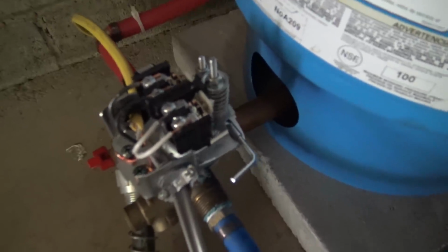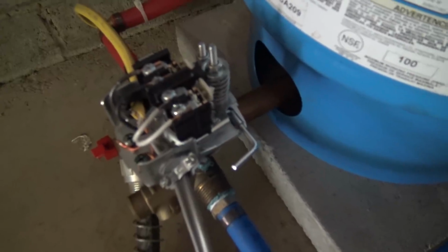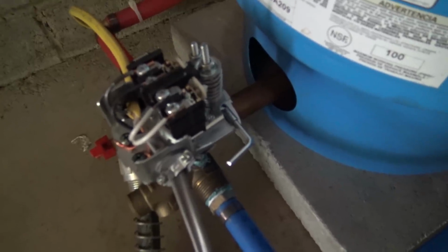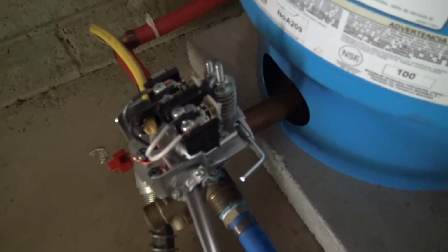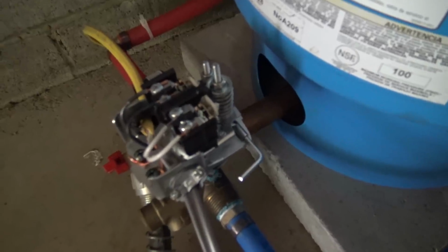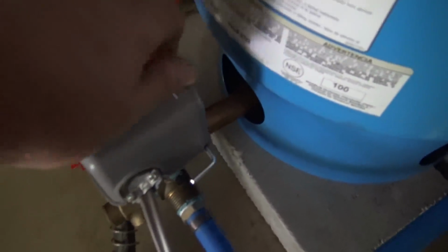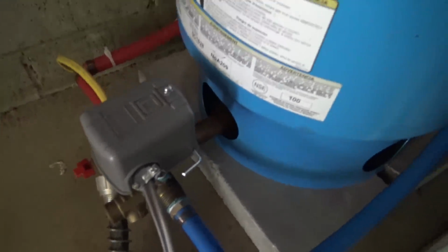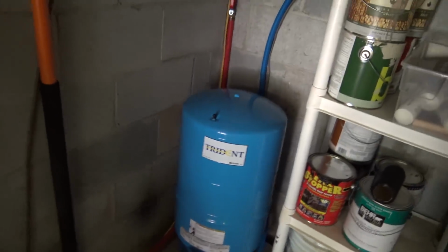If there were pipes busted, freezing, whatever, or they forgot to shut something off, this allows them to save their pump. The pump has dry protection built into its circuitry, but this is a mechanical solution because that's what I like. I understand it a little better. And so it's got some redundancy and backups. We've got double check valves, double low water protection, and we do it in the form of these Square D switches, which are relatively the cheapest low water dry run protection on the market. So that's it. It's cycling well, 10 gallons a minute, more than they need, more than sufficient.